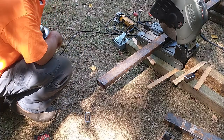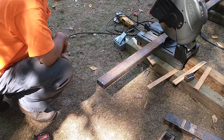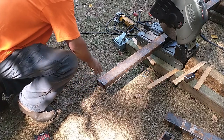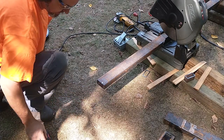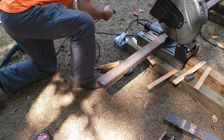I measured this — it was completely square. I should advise: don't touch that piece of metal or try to pick it up. I need to check all the squares on this. You always end up with a burr on the inside, so you've got to take the burr off before you can go measuring anything.